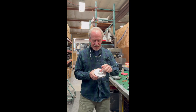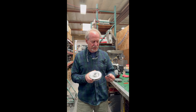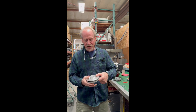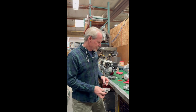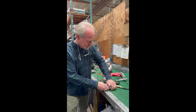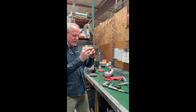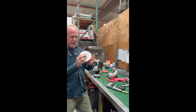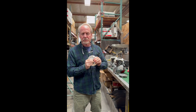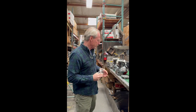I've gone ahead and lock-tied this inner steel hex into the back of the impeller, and I've already got the key set in place. Now I'm going to take my white ceramic pump seal and press it in. You've got to make sure it goes in straight, and you always want to make sure this surface is nice and smooth. Because if you've got any scratches on this ramp, it's going to take out your pump seal.